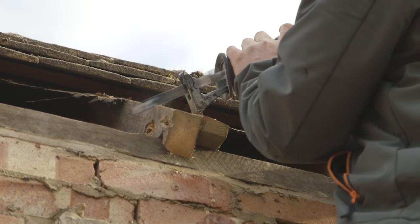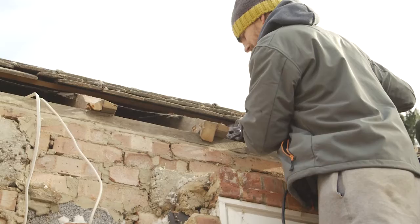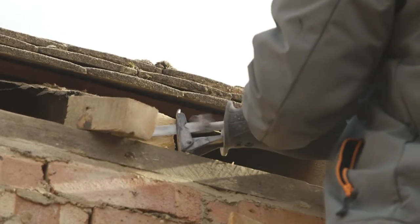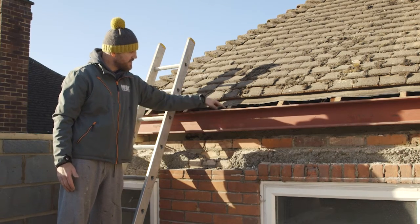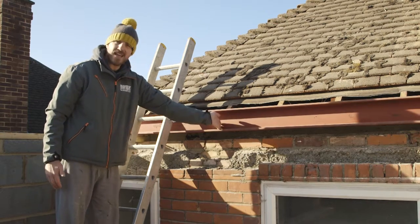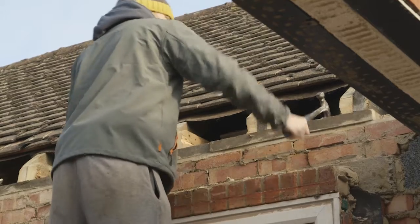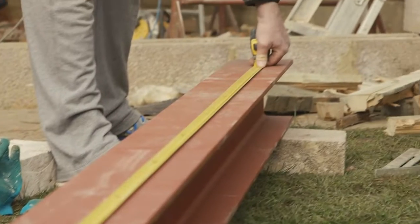In this case we're working on a bungalow where there isn't a first floor, so what we've had to do is the rafters have come down — we've cut them off square running behind the web, which is here. That rafter, if you imagine from this side, is cut into this web so that the roof is sitting in here. This web of the steel is taking the rafters, so all the weight is now in this steel, which is sitting on our newly formed plates and wall.